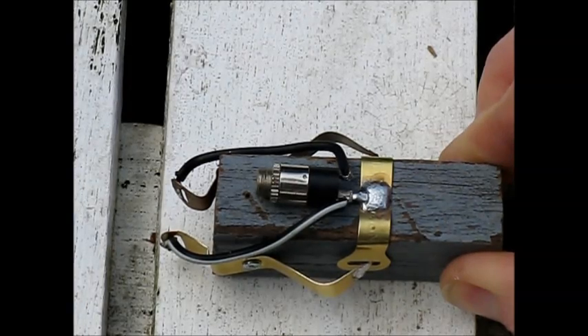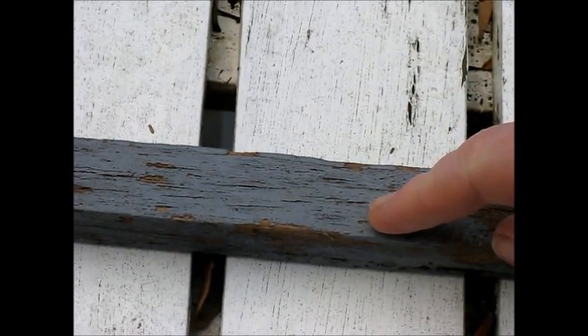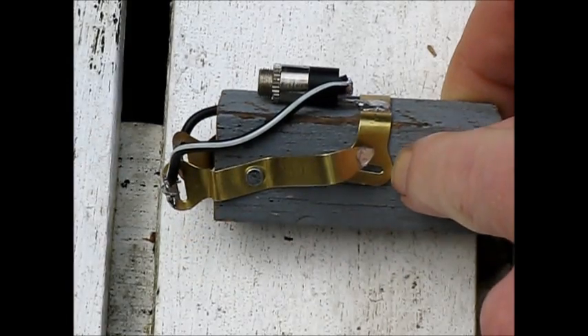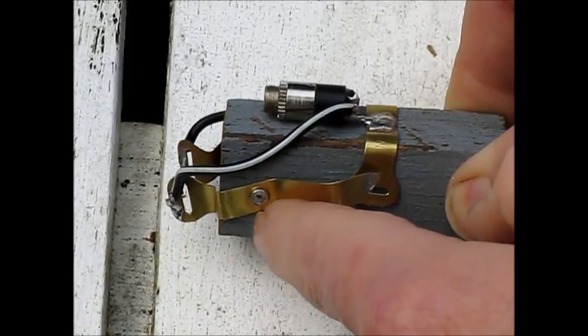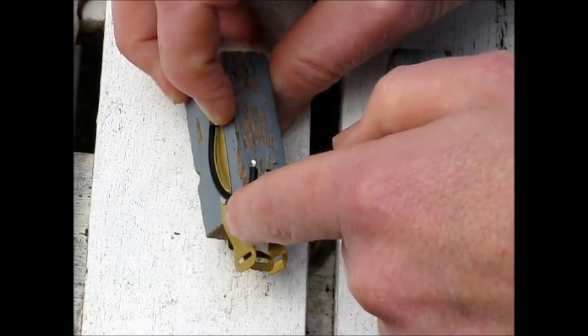There are different ways you can make a keyer, but this approach is my favorite. Because wood like this can split, I suggest drilling a small pilot hole with, say, a one millimeter drill bit into the wood first. One of the cable clips is knocked into the center of the wood and bent around. Then the two contacts are either side, nailed near the end of the block.